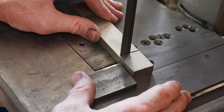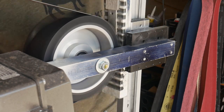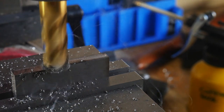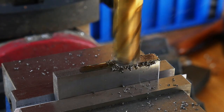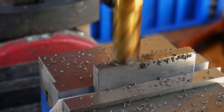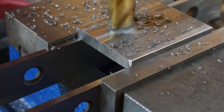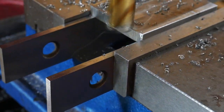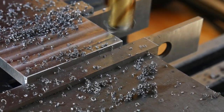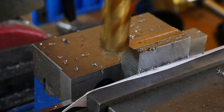I'm going to be using stainless steel for all the fittings on this knife — I'm pretty sure these pieces of bar stock are 304 stainless, and the pommel nut will be 316. The first step I make on all fittings is to get them square in my mill with a half inch end mill. While flattening and squaring up these pieces takes added time, I feel it's worth it to work with nice square flat pieces. I finished the flats with the half inch end mill but later came back with the fly cutter because I liked the finish it provided better.